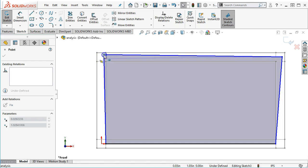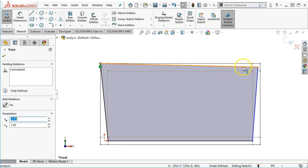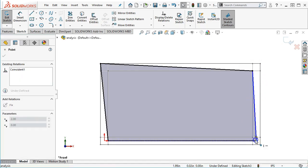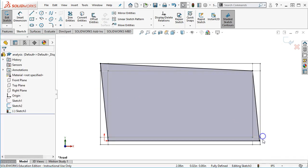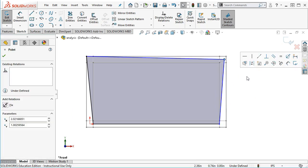And so within this little square, as we move around and it's able to pick up those items, if I go to another worst case, and I'm going to go ahead and let it apply the relation, then I would be 5 thousandths out on the perpendicular, and that would be 5 thousandths. But those aren't exactly parallel, because I wouldn't expect them to be parallel, because this one comes up to be vertical, and what's able to move? Oh, I didn't get that one. All right, so we can't move inside of the tolerance zone, but if this window is to move out, well, now we have the possibility that they're getting close. But perpendicular and parallel to each other, let's see what that would look like if I add the constraint and go to parallel. All right, it doesn't quite come to that point, and doesn't quite come to that point. All right, so I'm going to pull that one out, and Control Z one more time, and one more time.